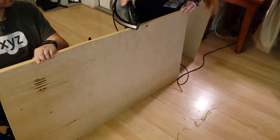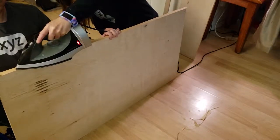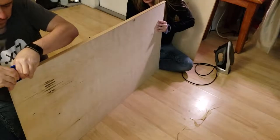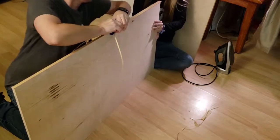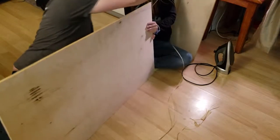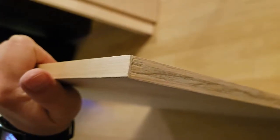The application is pretty easy to put on — just go straight down until you get all the way to the end. Now we're going to use our veneer cutting tool that we also got from Rockler, and go straight down the board until we get a nice clean cut on both sides. This saves a lot of time because it's double-sided. You can see the veneer matches right in with the wood layer on top and just looks absolutely beautiful.